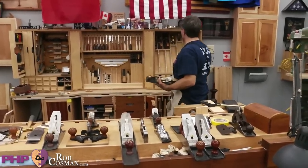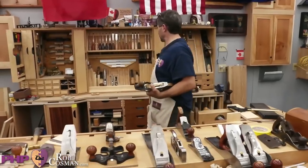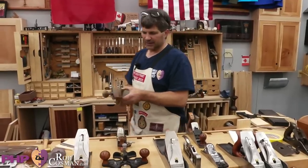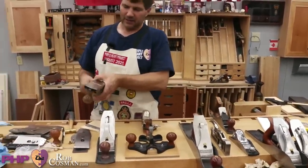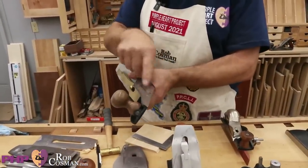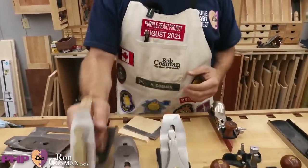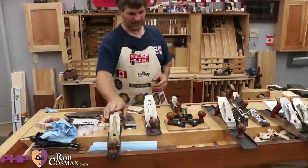As I'm looking at this, your skew block plane is strictly a specialized tool. Yeah, it is, but I mean, the skew block plane has more functions, I think, than the 10.25. The 10.25 is kind of a big version of a shoulder plane in that the blade goes all the way to both sides. You've got tilting handles. You've got nickers on either side if you want to score before the blade. You have an adjustable throat. It's a really great plane. A little bit on the expensive side if you're working on a budget, but I would definitely want it on my list.